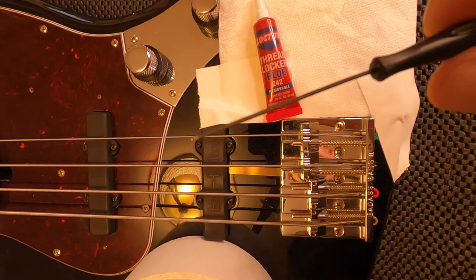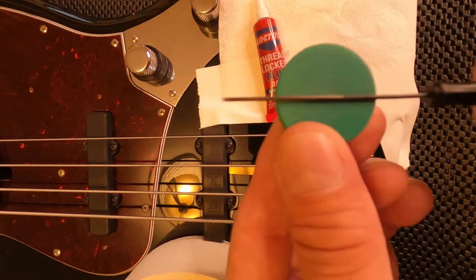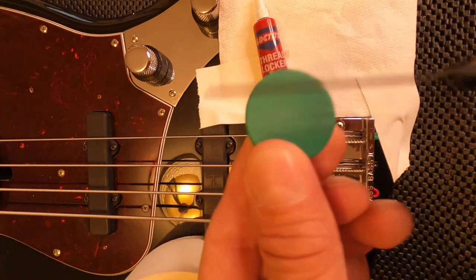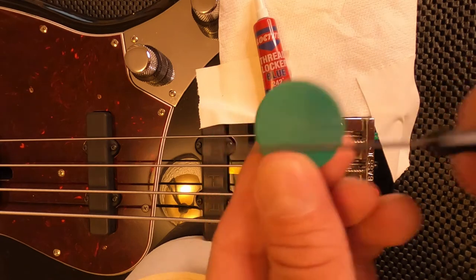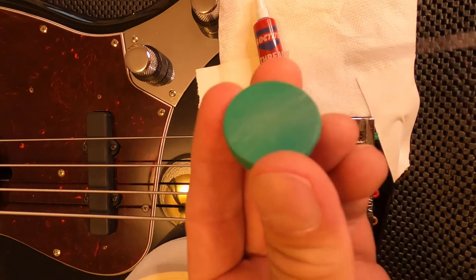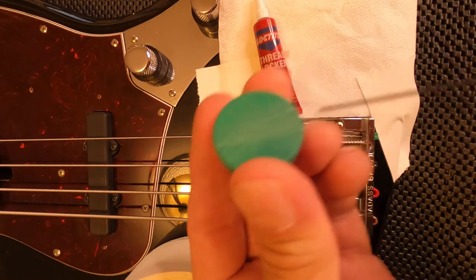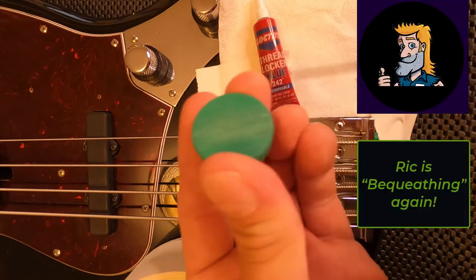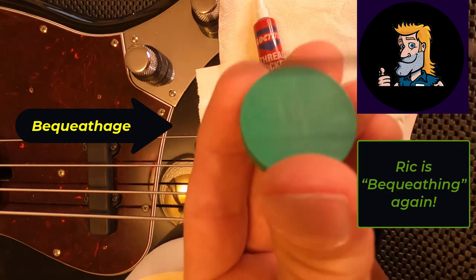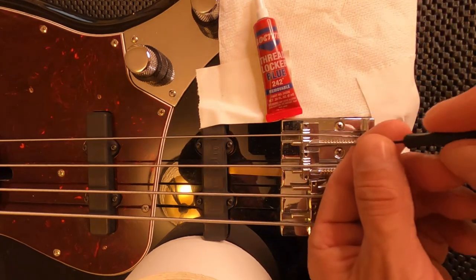What I like to do, a little tip here, secret, is I take my wrench and I magnetize it. That's the first thing I do, pretty much with all my tools that are not going to be touching a computer. I want this wrench to be magnetic, so when it hits the set screw, it holds onto it, because the set screw is really small, and we're putting this Threadlocker glue on it, and we want it to grip really well. You can do this with any tool made out of steel. You can magnetize it with just a refrigerator magnet, and I'm just running it across like that. Okay, that's done. Now let's take out the set screw.